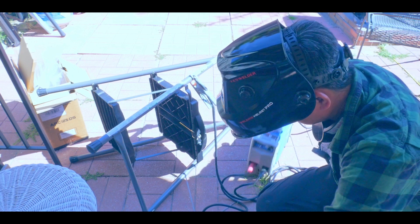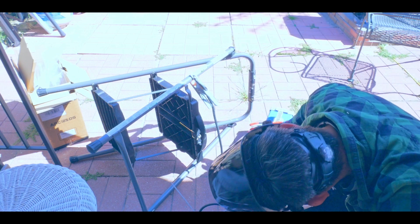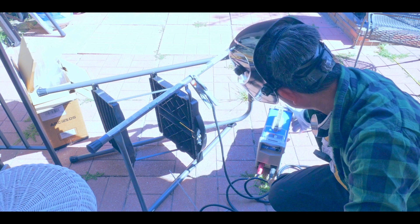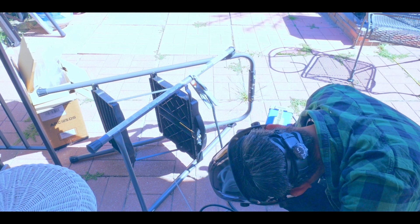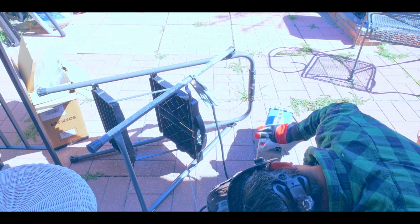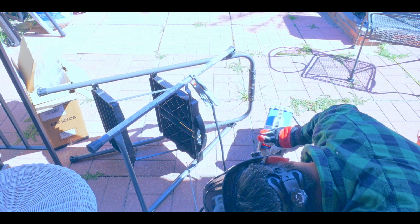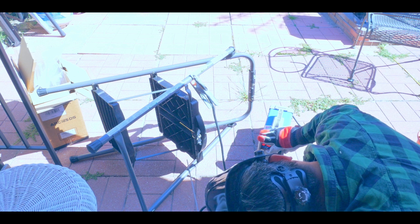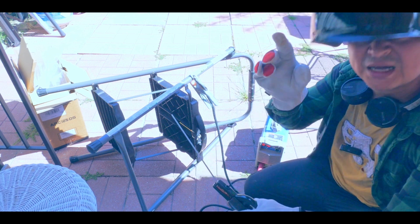I'm going to set the machine — turning it on now. You can go all the way down to 9 amps; I'm going to crank it up to around 70 amps. 70 sounds good. Then I put on my helmet and we'll get started.